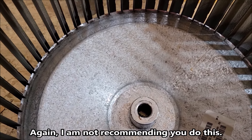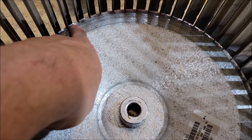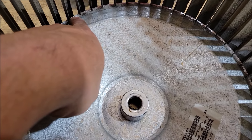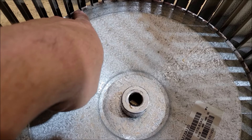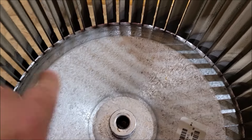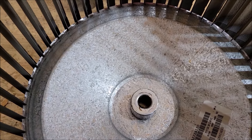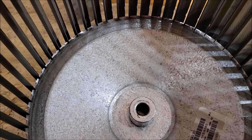I'm going to rig it - which sounds sad - but I'm going to get a flathead screwdriver, go in from the outside of the blade, and roll through this thing and hit this edge. It's a Y-shaped edge, so if you hit it with a flathead it should widen, and basically that should push that bend up against these blades and hold it together temporarily. I may even put a bend in the front and a bend in the back just so it doesn't move back and forth and wear itself out again. Man, this is crazy - I haven't seen this before.